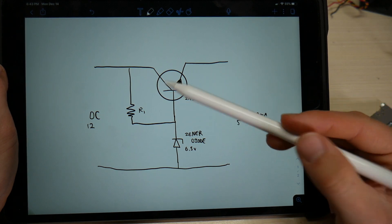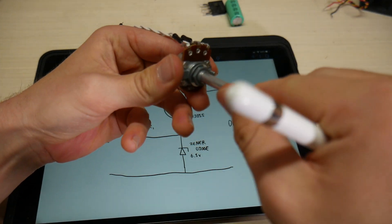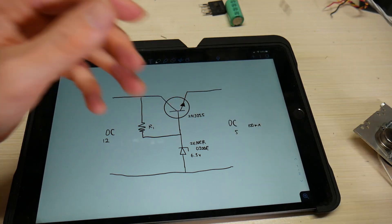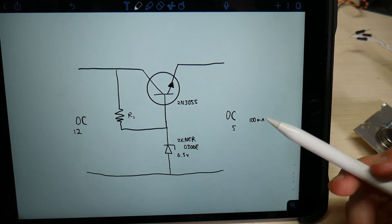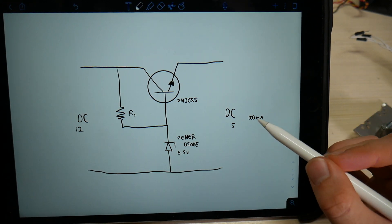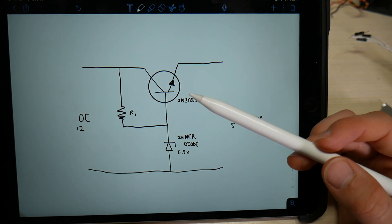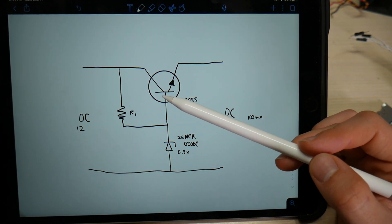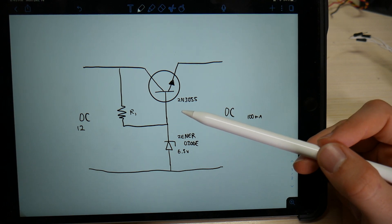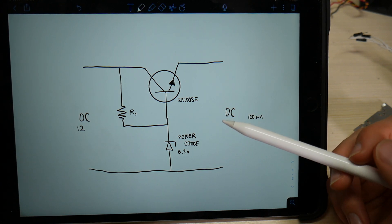And if you change the current, the transistor would continue to keep that consistent voltage drop. You can think of it as a potentiometer that changes based on the current to keep a consistent voltage drop across it — although a potentiometer is not a very good model for how a transistor works. One of the shortcomings is the amount of power dissipated in the transistor. There's a lot of waste here. If you had 100 milliamps being drawn, 7 volts at 100 milliamps is 700 milliwatts, or 0.7 watts of power lost in the transistor. Linear power supplies don't produce any high frequency noise from switching — they just linearly step down one voltage to another — but they do waste quite a bit of power.